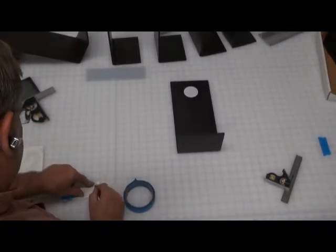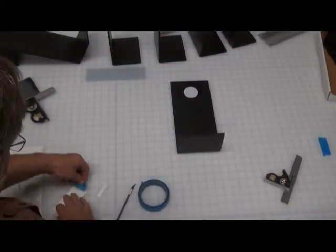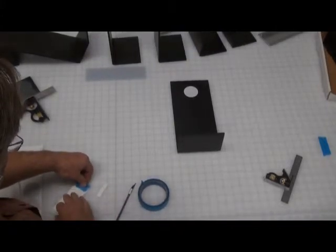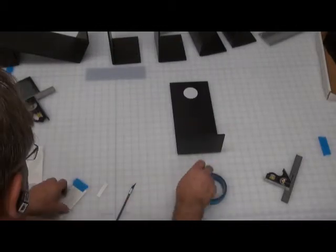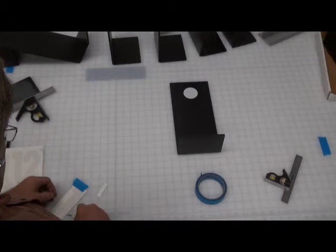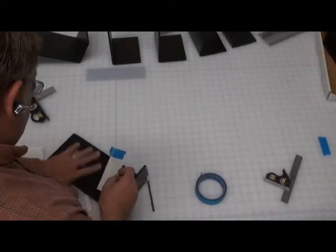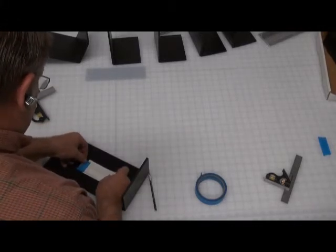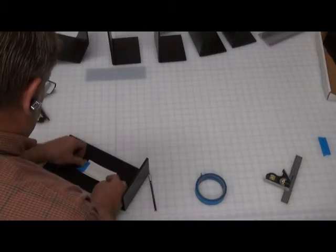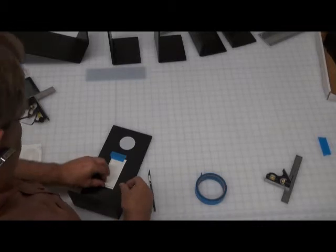And once you cut that off, then you can use your painter's tape, and you're going to make that like a hinge. So you actually put that on the very top, attach it to the transfer tape, then you're going to pick that up and put it right on the center. And I've got this designed, I've put mine at about 3.5 inches from the bottom. The numbers and the letters are not that precise, but if you want to have consistency, you've made your mark at 3.5 inches from the base. And then you made yourself a hinge.